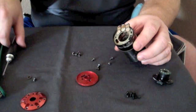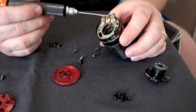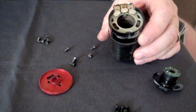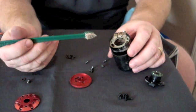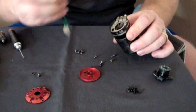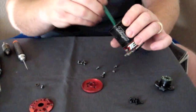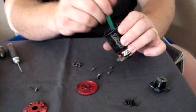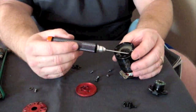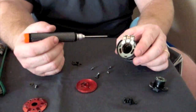Here's the rear end bell. You can see the solder tabs — I always check these joints for cracks. Eight scale is really rough on things, so if you're going to get a cracked solder joint in a motor, this is likely the place, right around the solder tab. This is where I stop disassembling the can. I take my doggy toothbrush and go in and out, lightly brushing all the dirt and grime out of this motor. You can use motor spray, but I think a good scrub down and some compressed air is best. Certain motor sprays do bad things for plastics, and there's phenolic material on the solder tabs and the winding protection plate, so just gentle scrubbing and compressed air.